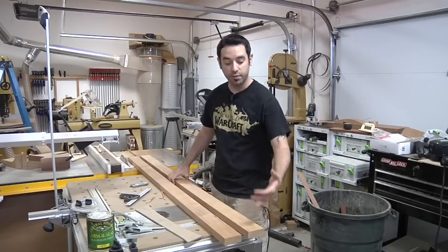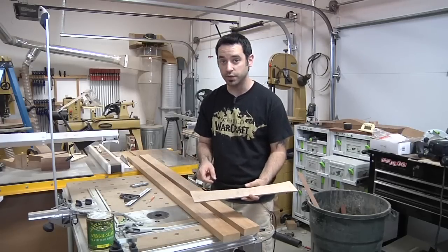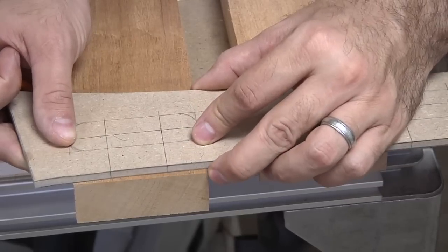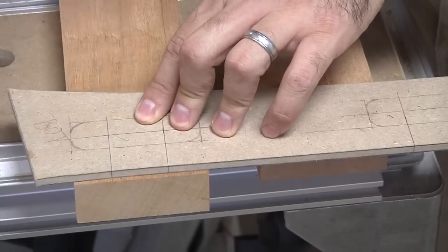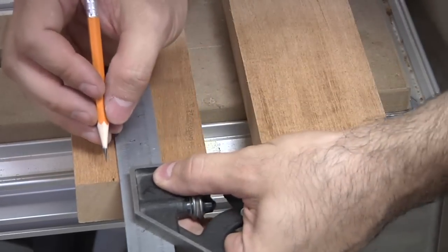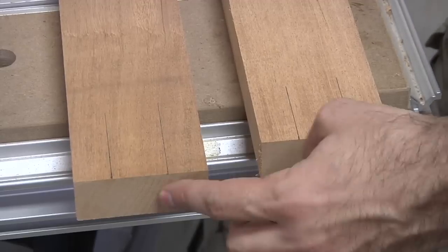The thing I need to do at this point is add the mortises on the end for the domino construction. We already have our lines on our template. I just need to transfer those lines to the ends of the workpiece. As long as my lines are roughly centered — you could move them one way or the other if you wanted to, but I think centered will look the best. Just transfer those lines down and extend them. Now we're ready for the dominoes.